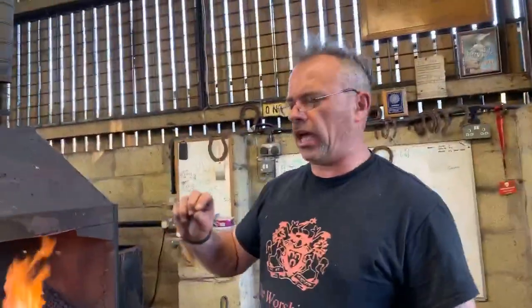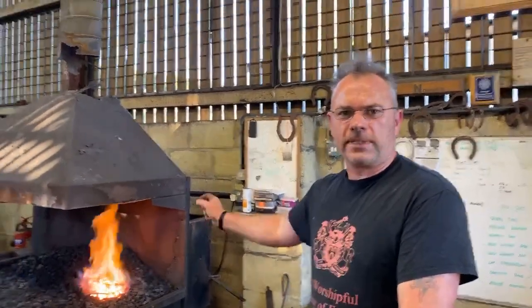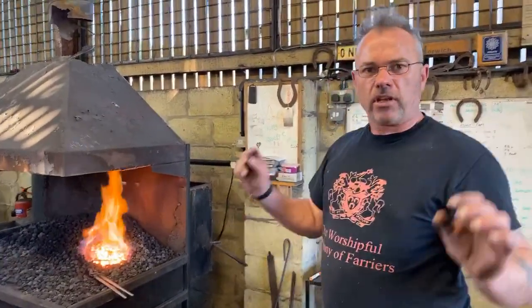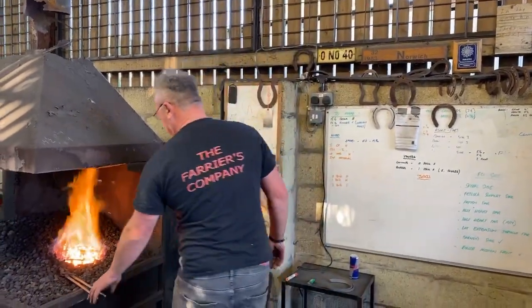People made last week on the last task set, if you look through everyone else's shoes, you'll notice Gareth's heels conformed exactly to that, rounded outside into the centre with the stone trap taken away at the right angle. If you look at them heels, they just stand out at you, okay, because they're right.